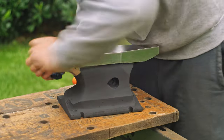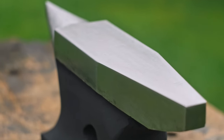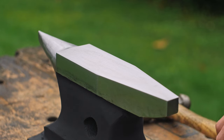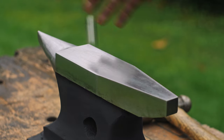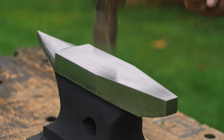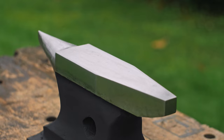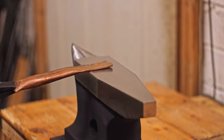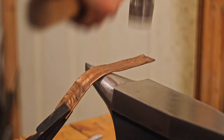After pulling the tape off we can have a look at the finished anvil, and I'm very happy with how it's come out. All of the edges are nice and square and symmetrical, and all of the transitions are nice and smooth. The anvil feels really solid — it probably weighs around 25 kilos. The railway track steel isn't fully hardened but it is relatively tough; the ball bearing still bounces off it nicely and you get a nice bit of rebound with the hammer as well. For the small detail work I'm going to use it for, it should be more than enough. First test: just flattening out a piece of copper pipe — it's just clamped down to the bench for now but seems perfectly good for smacking really hard.